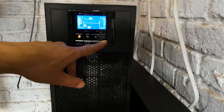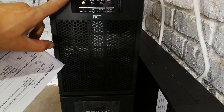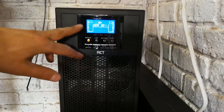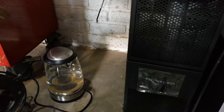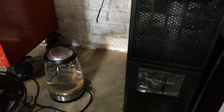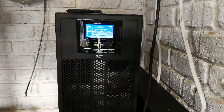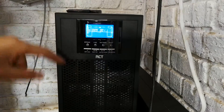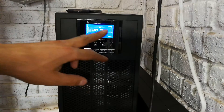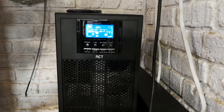This is very important — setting number 19. If you add an additional battery bank, you'll have to adjust this to tell the UPS how many batteries you've got in terms of amp hours. I have a kettle here and I'm going to demonstrate the backup capacity by switching it on to show how the available hours or minutes changes based on the battery capacity. I'm now telling it there isn't a battery bank connected — it just says one bank of nine amp hour batteries.